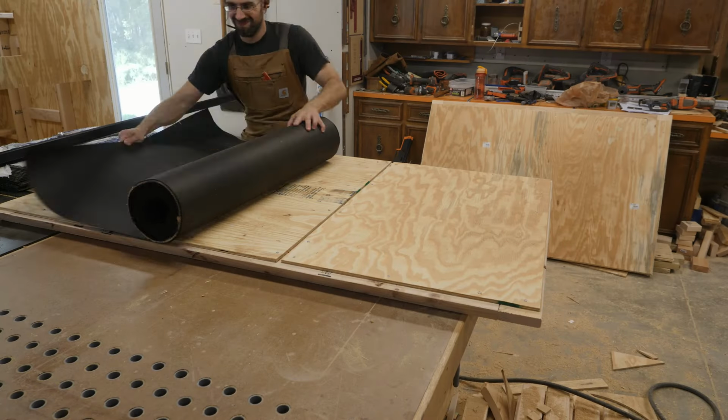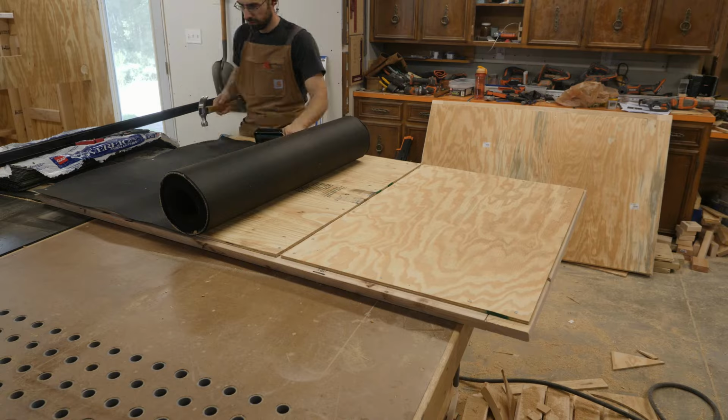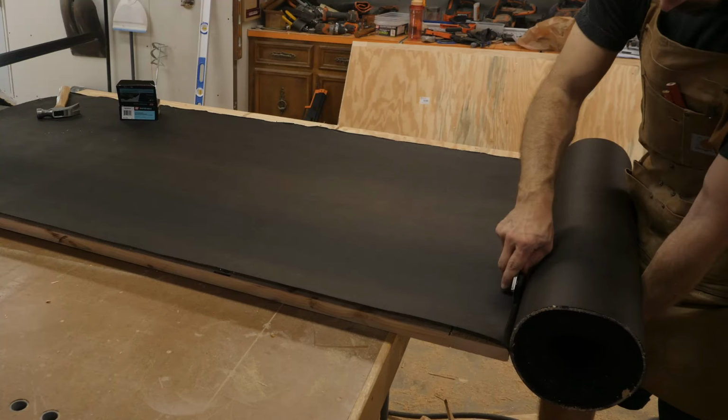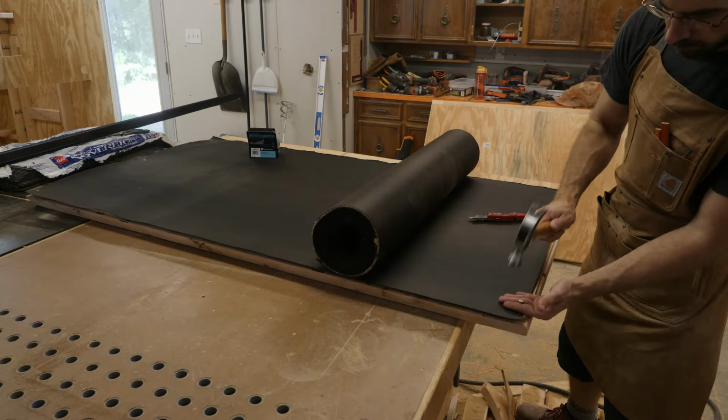With one panel sheathed, it's time to lay down some tar paper. Here I'm using 1 1/4 inch galvanized nails into 30-pound felt paper. Now this was my first time sheathing a roof, so I did a couple of things in the incorrect order. You're supposed to put down the drip guard first and then put the felt paper over top of that.